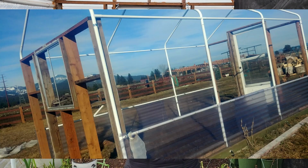As we were building the frame, we cut 45-degree pieces that we put in each corner to help keep everything square. We tied the frame together using construction grade screws. Being a carport frame that was meant to be driven through, it didn't have any supporting sidewalls. We were able to frame the front and the back wall with some extra lumber that we had from some other projects. We were also able to grab both a door and a window from our local Habitat for Humanity.